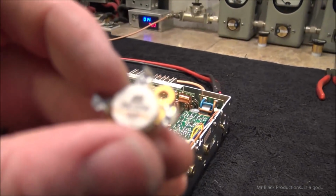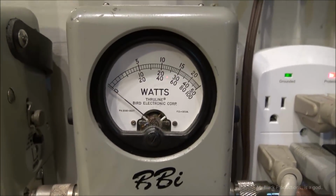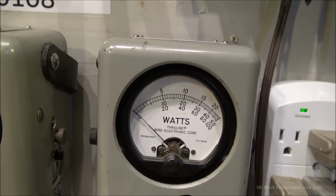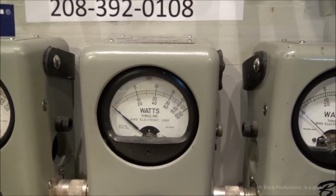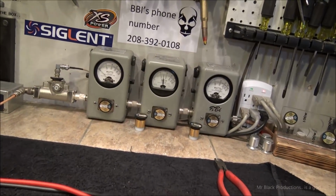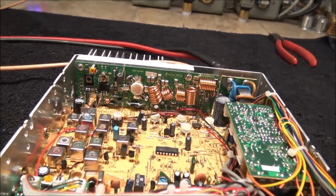Okay, so all we did was change the transistor, that pile of garbage here, the 2290, out, and put an actual Toshiba in its spot. Remember, 120 watts is what we were seeing before. So now we're seeing about 140, and already more bird. Yeah, now I see why I sent both radios. We just picked up, what, 10 bird by changing just the transistor.